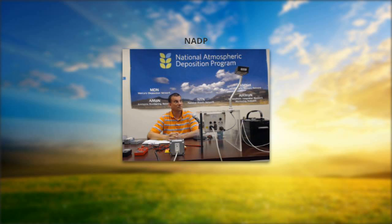That worries me — we could have initially a power problem. This particular site, set up in a mock fashion, is AC with a DC backup. Initially I want to check my AC source. Being a GFCI-type setup, I do not want to start at the collector and work backwards trying to determine what my problem is. I'll start at the source — the plug where the collector is actually plugged in.